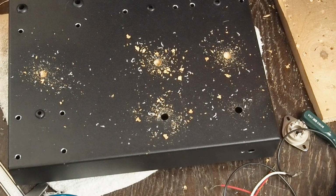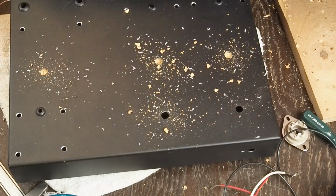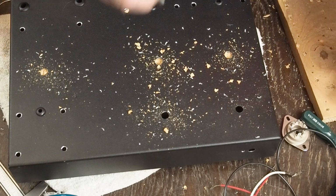Hopefully we got the right size hole. One thing you want to know too on these Greenlee punches, you want the hole to be very close to the size of the bolt. You don't want to go way oversized, because then you lose the centering that the bolt provides.